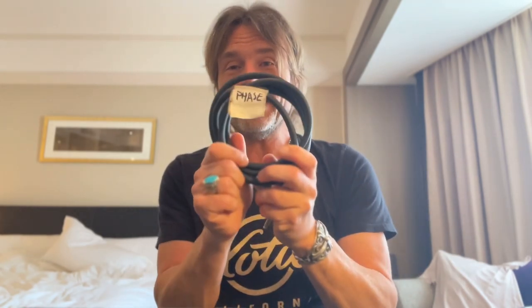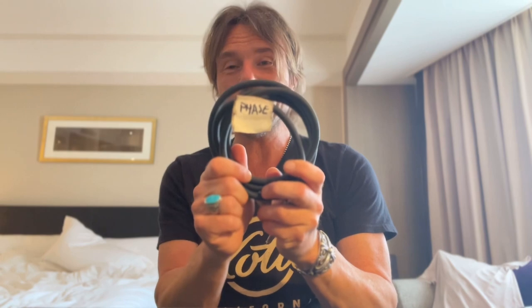This cable is essential for a two-amp setup — bring this. I love this cable and I take it everywhere, because this happens a lot. It sucks when you feel like you're playing two amps and wonder why it sounds so thin. There might be a cool little box out there to flip the phase, which would be amazing. Next time I'm building a pedalboard I'll make sure the unit going out to the two amps has that on one side, but until then this is an easy way to deal with it.